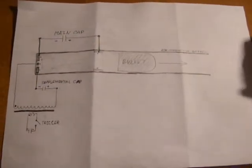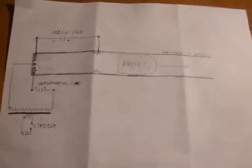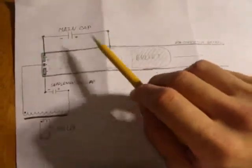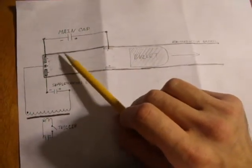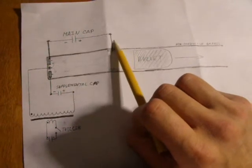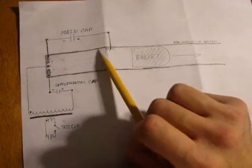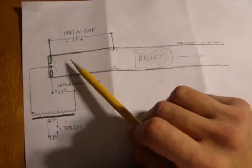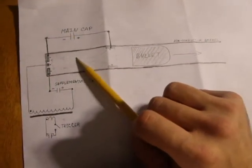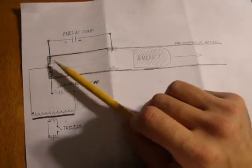This is an improvement of the previous design. We still have those two electrodes in the far corners of a discharge chamber, and the barrel is non-conductive. The setup is the same, except there is no transformer between the discharge capacitor and the electrodes. We still need to somehow get ions inside the discharge chamber to initiate the discharge between the main electrodes.